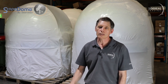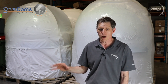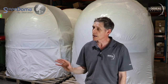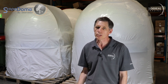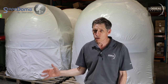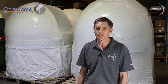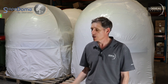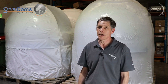So there you go. I really like the 2m scope dome — it's quiet and it's smooth. Because it's delivered in a single piece, it's solid and not flexible, meaning the dome and the shutter don't have to hop over joins or other uneven bits, and that's going to make it really reliable, which is what you want if you're setting up for remote observing. Because it gets its power from the ring, you don't need to worry about charging a battery on the roof, which again makes it more reliable. You can put a good number of scopes in it — you're really constrained by length, not aperture. You could probably even get a 17-inch CDK in there. I think that's probably all you need to know about the 2m scope dome. If you like this video, have a look at our other ones on the Sidereal Trading YouTube channel. I'm Bill from Sidereal Trading, and I'll see you next time.